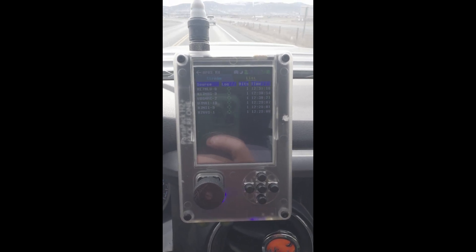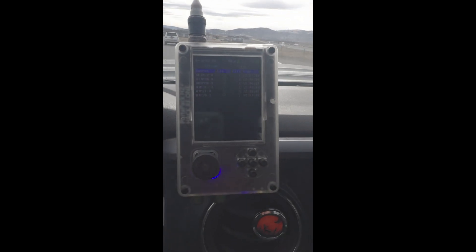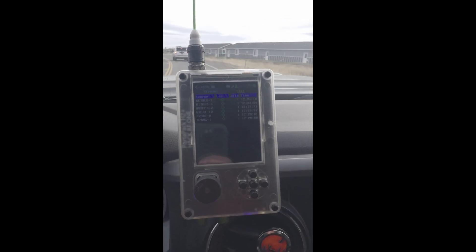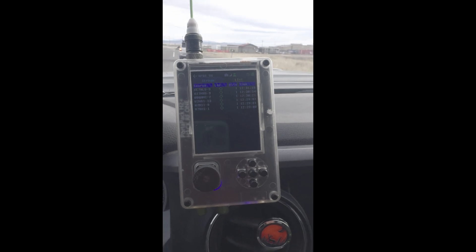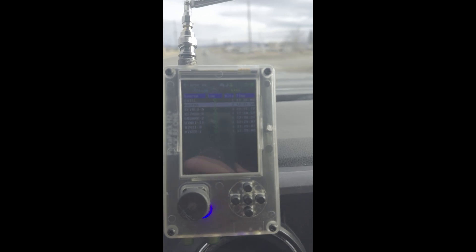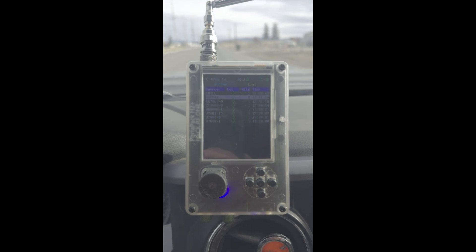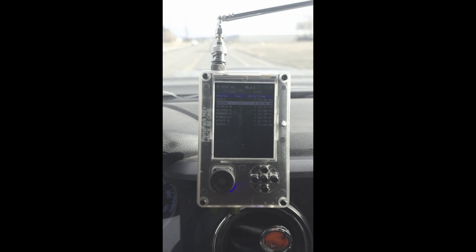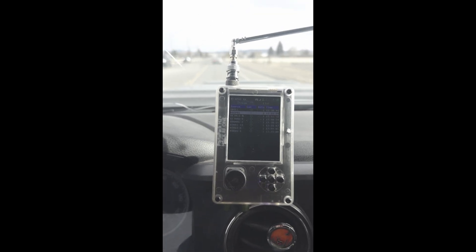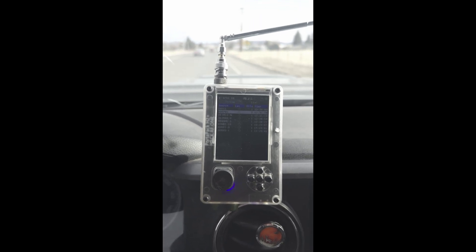Definitely check your VGA and LNA settings on your device. I'm still on the Signal Stick antenna and we are getting good hits. When I stop again, I'm going to swap antennas back to the telescopic to see if we get those same hits - for those of you who may not have a proper UHF/VHF antenna. I put back on the telescopic antenna and just got a hit, but I did have to extend my antenna all the way. The stock telescopic antenna is definitely capable of receiving APRS, but you may need to adjust your settings accordingly, because a note that came in on the Yaesu did not receive on the PortaPack. Antenna strength, length, and frequency definitely matter for APRS.